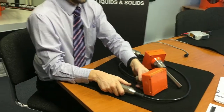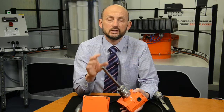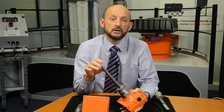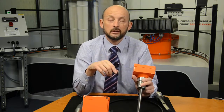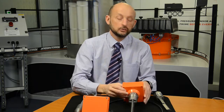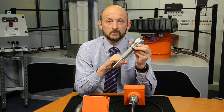The technology operates on very light fluffy products, down to 20 grams per liter. There is another reason why we use these in our safety systems — reliability is critical, but also the ability to do a ground-level test. At the bottom of our silo we can check that the probe is working by actually stopping the inner probe from oscillating and vibrating.